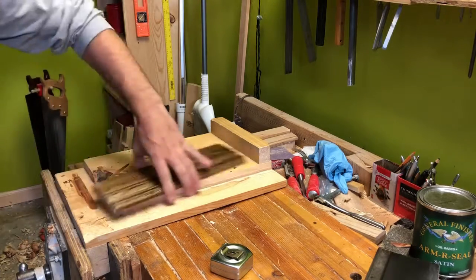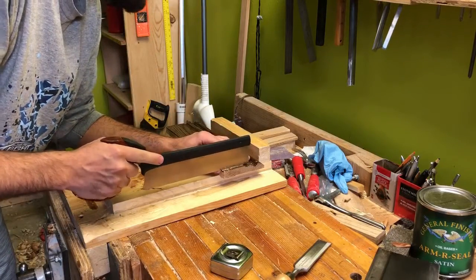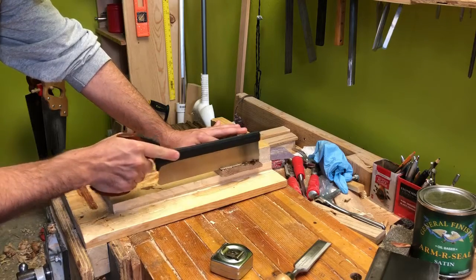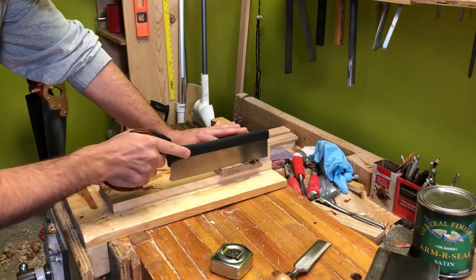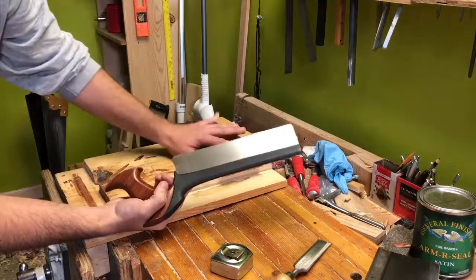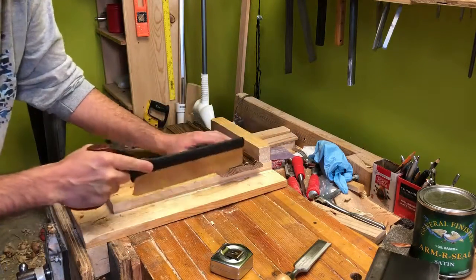Man, I really want my saw to be able to register in a cut. Now, I got my dovetail saw. This is cut up for rip, but really, I found that rip saws work very well in a crosscut. But crosscut saws don't rip well. I've read things that say both ways. Back in the day, guys used to either file their saws for rip or crosscut. I imagine, much like anything, it was probably personal preference.